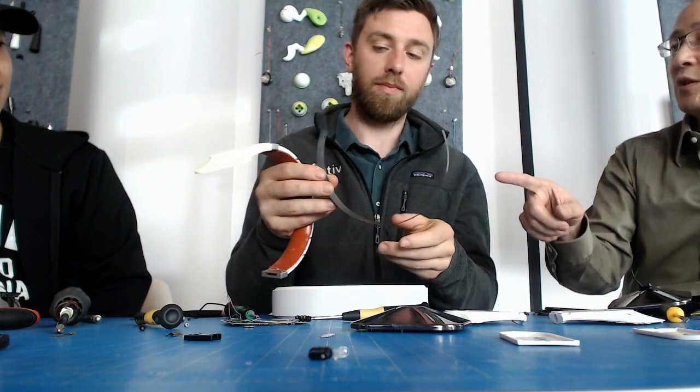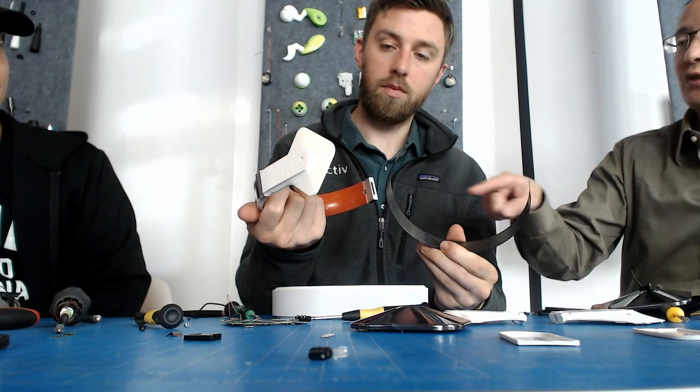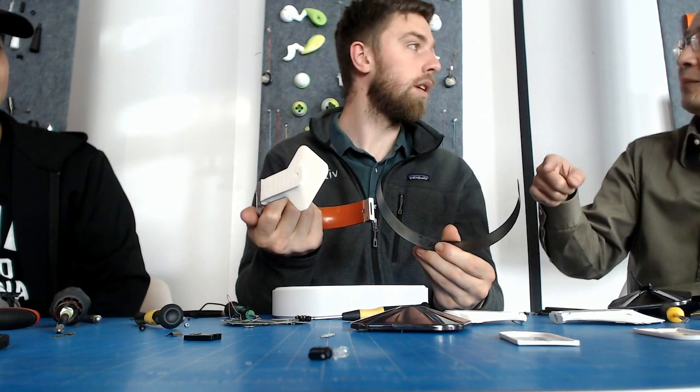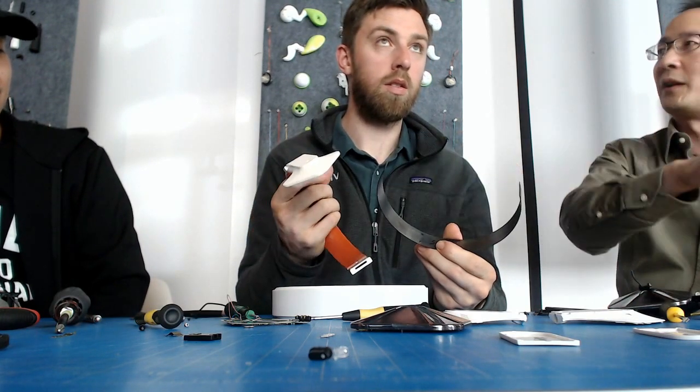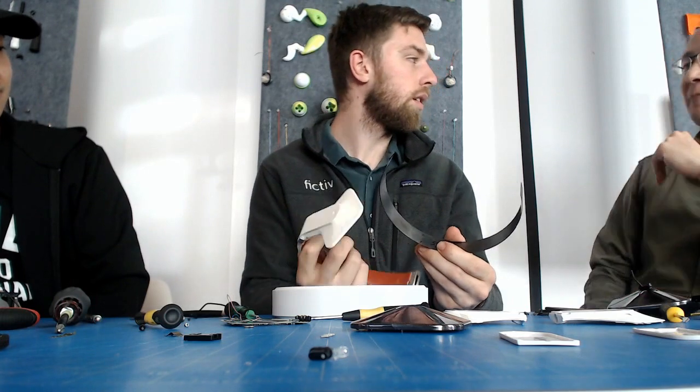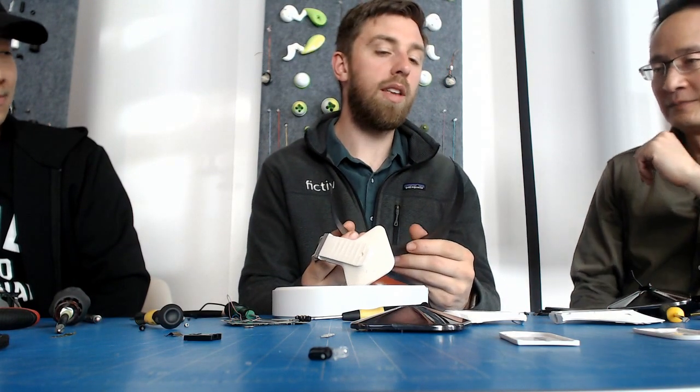But one of the things that was important before it gets into production is how do you know it gives you the same clamping force every time? So we actually made them do a go no go gauge. We test the spring on the steel before they put it in. Oh, really? Because once they put it in, they can't take it out again. And what did that gauge actually look like? So there's a little test jig that has fixtures, with pressure sensors on either side of the fixture. When you put it on, it presses down with a certain force, and they measure it and record it. I think we were hoping to achieve plus minus 5%, but I think we ended up somewhere around 10%. Got it, 5 to 10% on a go no go for this.